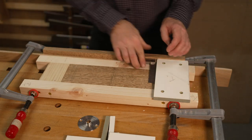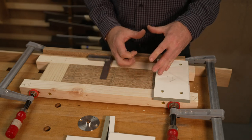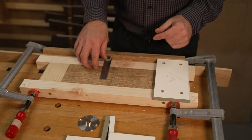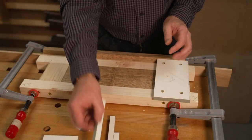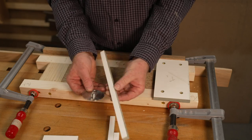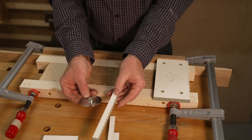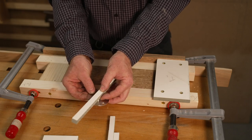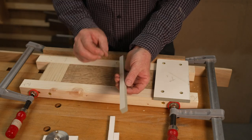So we've offset this 2 mil off of where our mortise hole wants to be. That's important, okay? Only 2 mil, not 4. Now, I've also been and cut carefully a bit of MDF, same material, to that 14 mil width to match that guide bush. So when I've cut these, I've measured them with a vernier, checked they feel right.